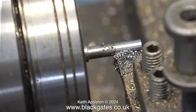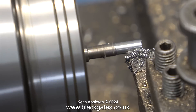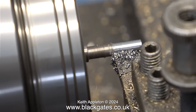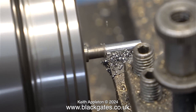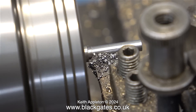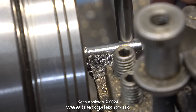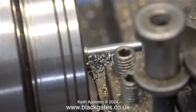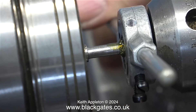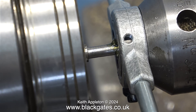Time now to start the job, and first of all I'm doing this wrong — I need to show you one or two pitfalls when it comes to threading stainless steel. The first one is: never let the tool rub on the work, because stainless steel work-hardens very quickly. It's generally okay with carbide, but with high-speed steel it will just remove the edge almost immediately. What I'm trying to show here is what happens if you leave the part oversize and then thread it.